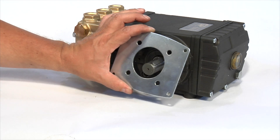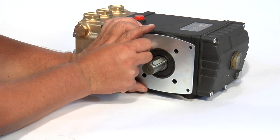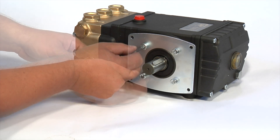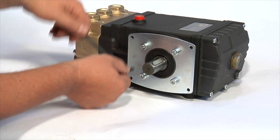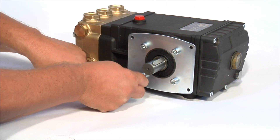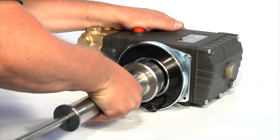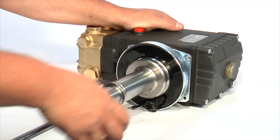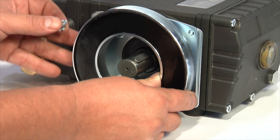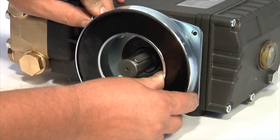For most water pumps, the pump manufacturer or distributor will provide a mounting plate that bolts to the pump face. Install the mounting plate and tighten the four bolts to the pump supplier's recommendations. Some pump suppliers provide a centering tool to make sure the mounting of the clutch pulley and field is concentric. Install the clutch field and bolt on with the four bolts provided for an outside field, or three for an inside field mount.